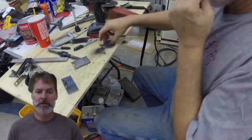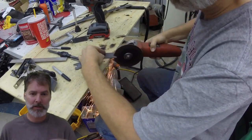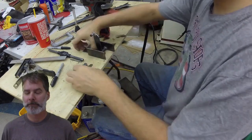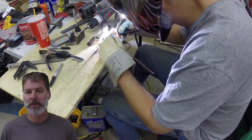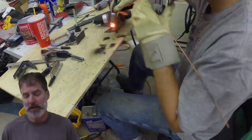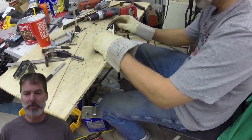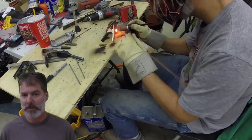Here we're building a couple of guards. I'm going to put my little extra arm inside the tunnel. In order to make it as tall as possible, I put the hinge point at the very bottom of the tunnel and the attach points near the top. If you've got water lines running through the center of the tunnel you're going to have to look at a different design. These little guards protect the electrical lines, hoses, and cables inside the tunnel — I don't want them touching the moving parts. By putting a guard up on either side it just holds them away and prevents chafing.